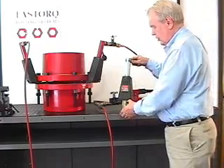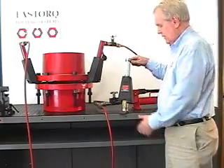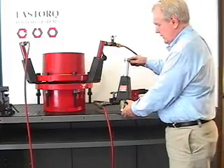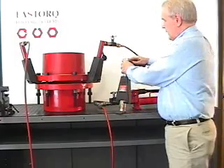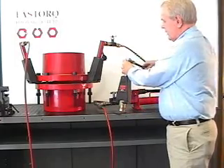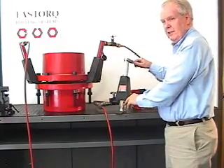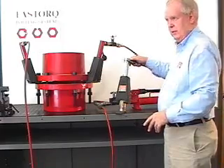It can also be used to lift and level heavy machinery. By putting these jaws under the foundations of a machine — such as a motor or a turbine — when aligning it and getting ready to shim it into position, the operator can very accurately adjust the level and then place the shims and lower the machine into position.